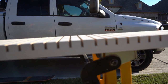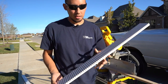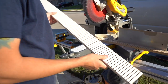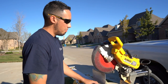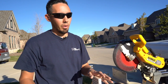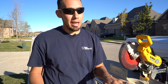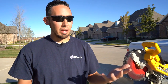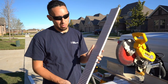Every half inch, half the depth of this three-quarter inch piece of 1x4 MDF — and it should flex. Now with this spacing, it doesn't have to be exactly every half inch. Obviously there's some human error in there where I'm not a robot cutting it right on the money, and it doesn't have to be super precise in that respect. If you have one cut that's half inch, half inch, half inch, and then one that goes to quarter, the only problem is the board is going to become very weak right there — it'll be the weak link in the chain. So try your best to keep them spaced out evenly and you should be good to go.